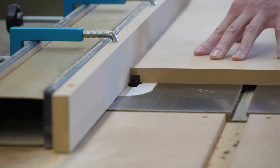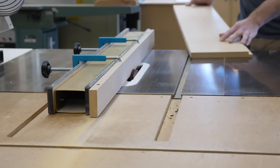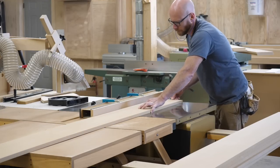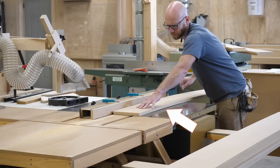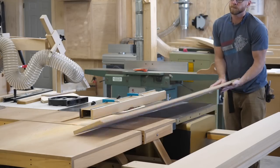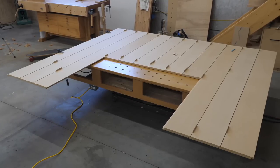After the pieces have been cut out I needed to add the rebates, which are 3/8 by 1½ inch. I buried my dado stack in a sacrificial fence and got to cutting. I like to run each cut through twice just to make sure I'm getting a consistent cut. I happened to capture the first mistake I have ever made while woodworking on camera — I didn't keep the piece pressed down to the saw surface, so when I put everything together for the first time the lap joints didn't quite lap right. So I had to go back and run them again. Lesson learned: don't make mistakes.